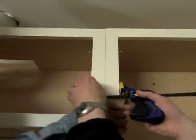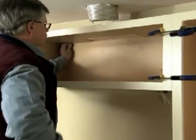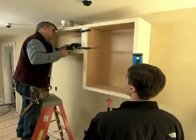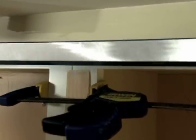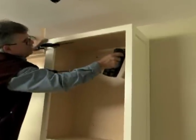Clamp those two together and grab the other clamp. Now I'm going to put a screw over here on the top to hold the cabinet so it won't fall. I want to screw the two cabinets together using an inch and a quarter screw just behind the stile. Now I want to take a six-foot level and lay it on the face of the upper cabinet to make sure that the cabinet is straight. I've got a space right behind the level — that means the wall is bowed in. So I'm simply going to loosen the screws in the back of the cabinet and install a shim behind the cabinet to pull the bow out.